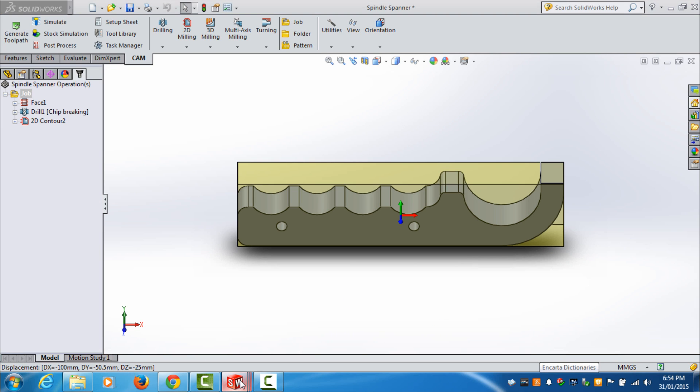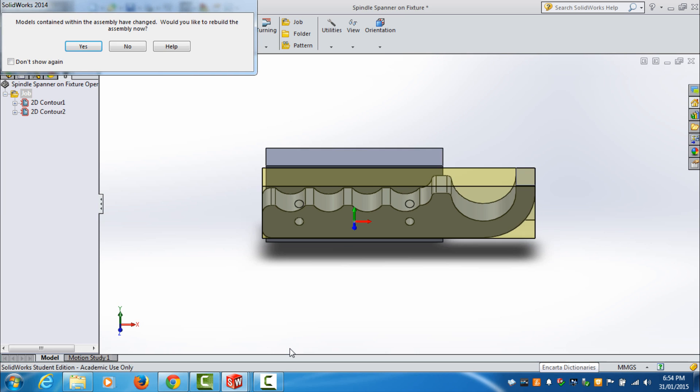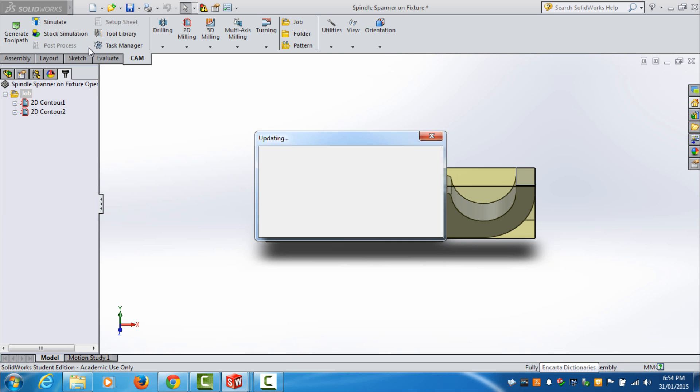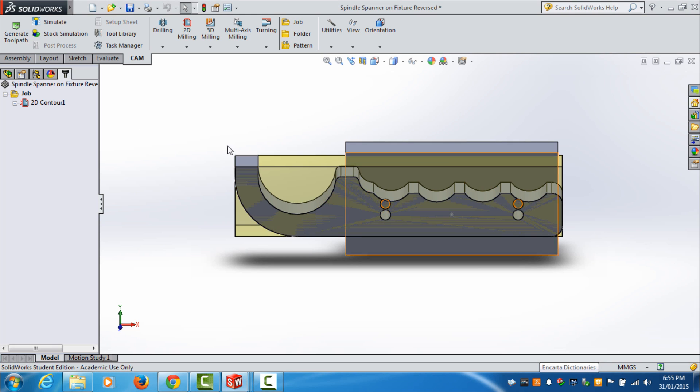For the rest of the part, I drew a fixture plate and rigid tapped it with the mill as well. Then I attached it to the fixture plate and told HSMWorks which one's the fixture and which one's the job — and you can see the stock has gone around the spindle spanner. This is a cleanup full-depth path with a chamfer around the top edge as well. And lastly there's the part flip where I flip the part and chamfer the top edge on the other side.